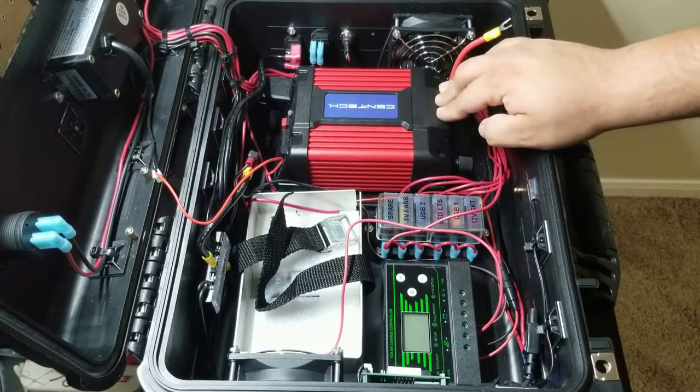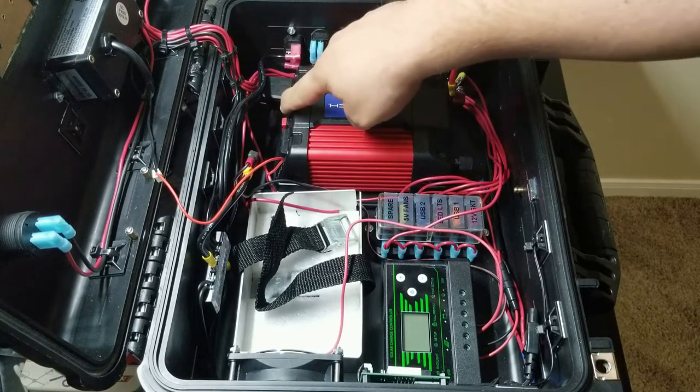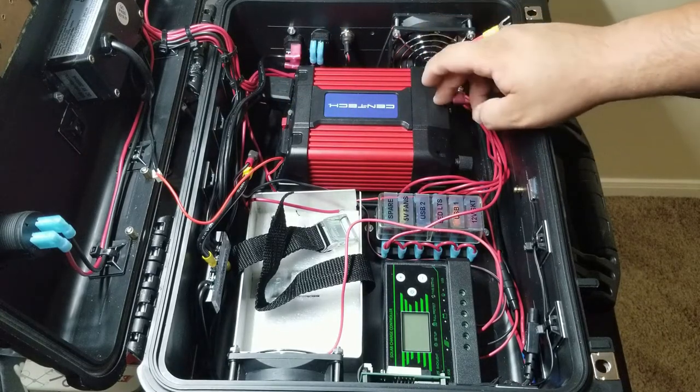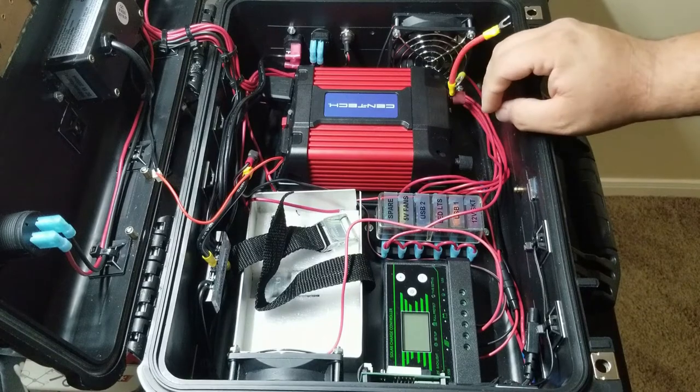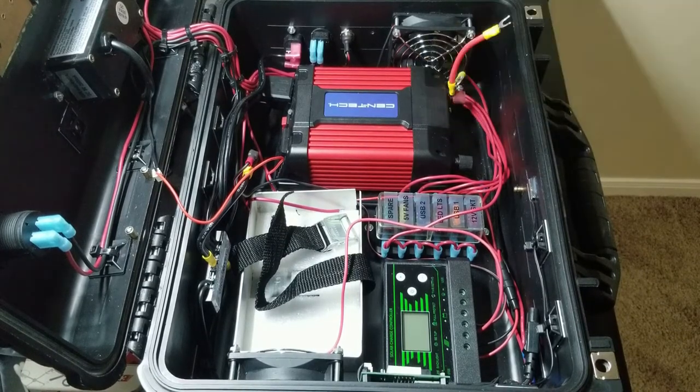But this one does cut out at 10.5 volts. When it reaches 10.5, it's going to beep, the light will turn on consistently, and it's no longer going to make an output. So this is a nice little inverter for the price, and the link is also in the description.